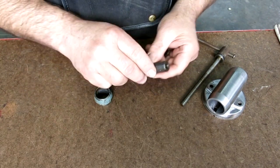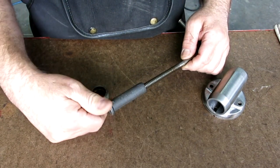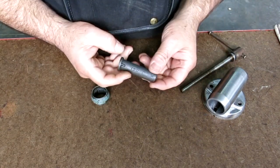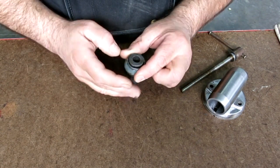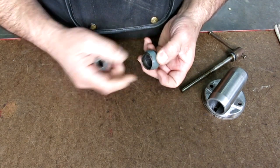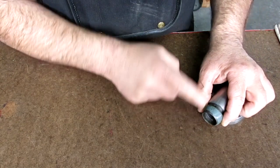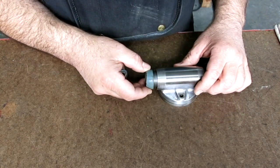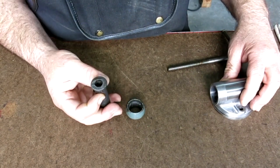This is the nut. This is actually the lead screw nut, or the nut that draws everything together, and it's made out of cast iron, and it fits in this little nut carrier, is what I call it. And this little guy actually fits on the rear end here and makes the actual part of the bullet shape of the rear end of the vise. Okay, so we're going to make that guy, and we're going to do the nut.